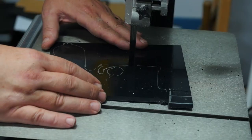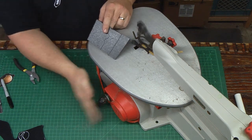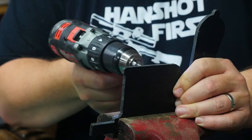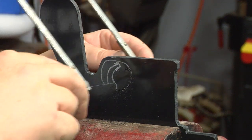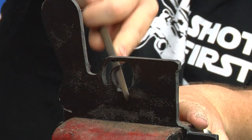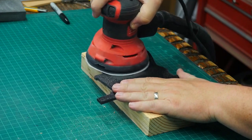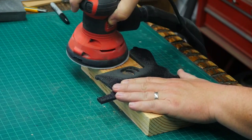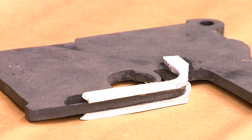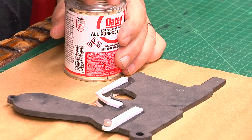I made a tab to glue the barrel to. I used the bandsaw to cut my shape because the scroll saw cuts too fine and melts the ABS back together after cutting. To cut out the trigger I set the plastic in a vise and use a jeweler's saw with a spiral-cut blade, which made all the rounded cuts very easy. I do a little filing on the edges to clean it up and bull-nose the trigger. ABS plastic has a texture on one side so I sand that off and sand the glossy side so contact cement can hold better. I drill the holes in the hammer and that key ring part, then use a styrene plastic sheet to make the trigger guard a little bigger and make the safety switch, to which I add a knurled knob saved from something a long, long time ago.